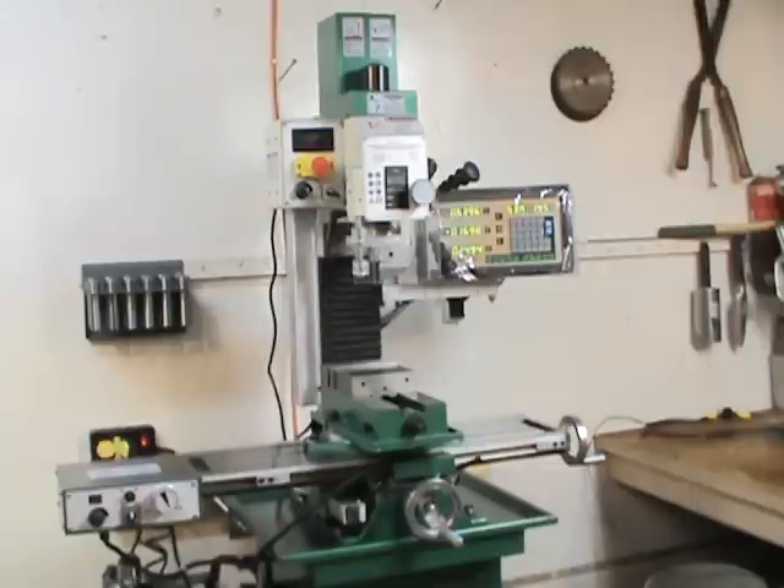The machine has two types of fuses in the back — inside the power control you have a 10-amp and a 15-amp fuse. They're 5mm by 20mm and they're kind of hard to locate. I was lugging the machine a few weeks ago and did pop a fuse, so that's how I know there are two types of fuses in the back.